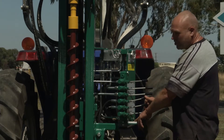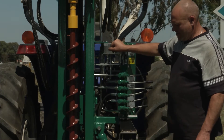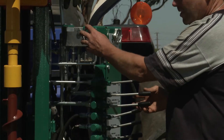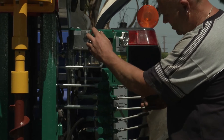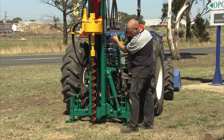We need to level the machine up before we start drilling. Using the auger feed tap, lower the auger down to the ground, and then operate the auger control — auger forwards.